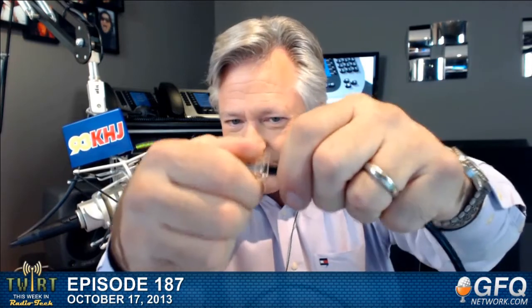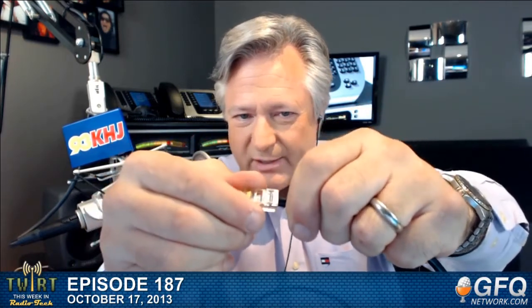Now this is outdoor cable. It doesn't push as easily. On indoor cable, that jacket will slide right up in there another maybe 3/16 of an inch. Now I'm holding the RJ tightly up against the cable. Now I'm going to put it into the crimper. I'm holding the jacket of the cable, really shoving it in there, and give it a good crimp. And there we go. It's done.